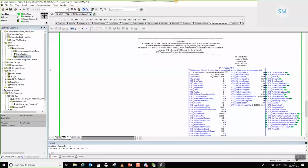Okay, so when you're starting up the axis for the first time, the things that you're interested in are status cyclic comms. This particular output is green, so it means it's set, indicating that you haven't got an error. You want to make sure that you have no AOI active errors, so that's telling you that you've got no input or output problems to be able to control it. As you can see, this is 0, so that's okay. Now, because we are doing an RTMOE application, it's also worth noting that the status of the RTMOE connection from the perspective of the M700 is shown here as well, so we know that our synchronous cyclic comms are actually working. Important to know.